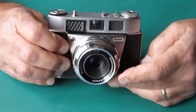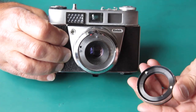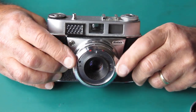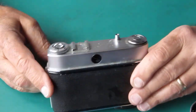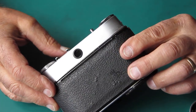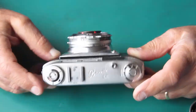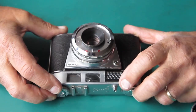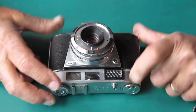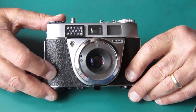This particular camera has come to me for a service. You can see it's got one little problem — the focus scale ring is loose and falling off. That's a simple matter to fix. The shutter certainly needs to be serviced; it's unreliable in its action. Possibly more importantly, the rear viewfinder eyepiece is missing. It probably means it's fallen in — hopefully it's rattling around loose inside the top of the camera, or someone may have already removed it and the part is no longer available.